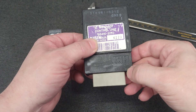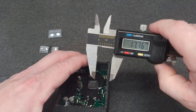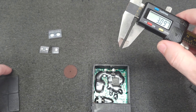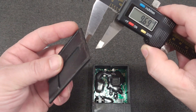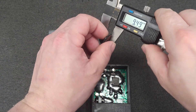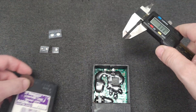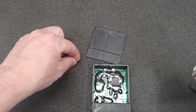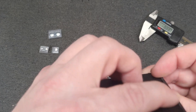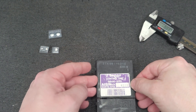I went about 25mm up from the base, estimating the wall was going to be about 3mm, which it is. The top is a little less at 2.48mm, so if you add your cutoff wheel distance that's 3.31mm — so 4mm was a good educated guess. You could have got away with 3.5mm, which would have given less of an edge for re-epoxying, but it should epoxy back down fine.